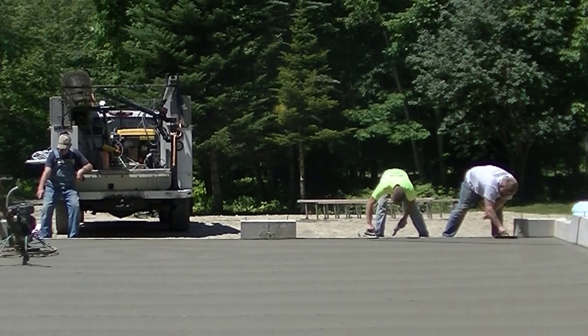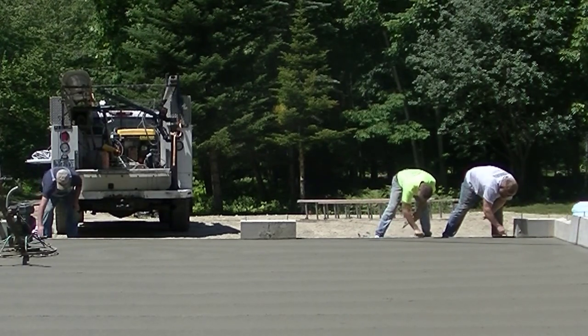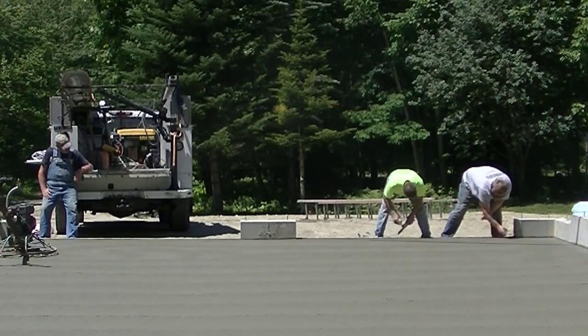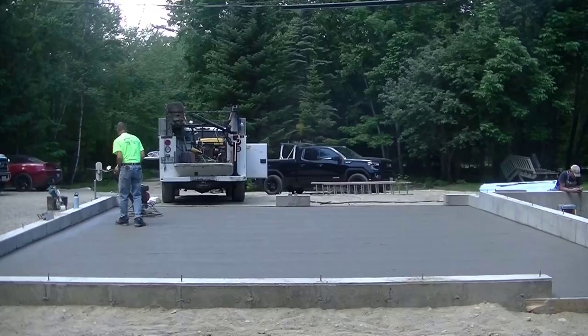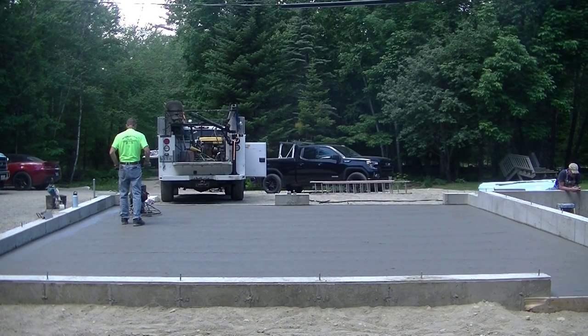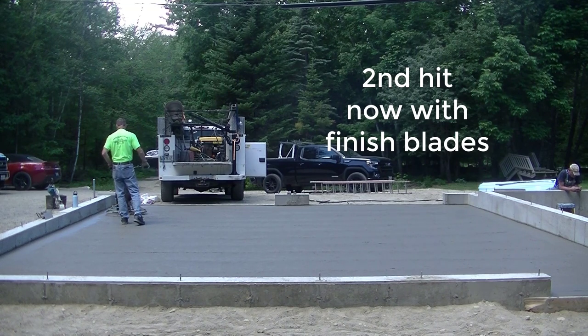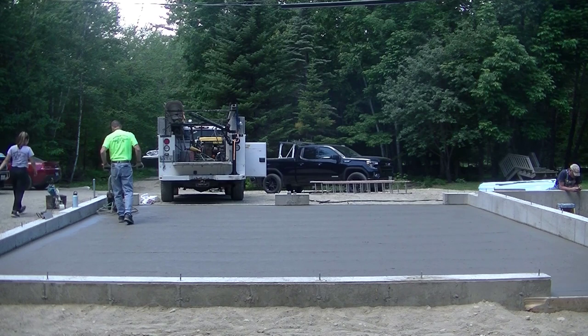The timing all depends on how hot it is and how much sun there is. On this one I had about 30 minutes before I had to hit it again. Me and Darren were over there working on the garage doors - we always slope those garage doors a little bit so when rain water hits the outside of the garage door and runs down, it hits that slope and runs out of the garage instead of running back under the door.